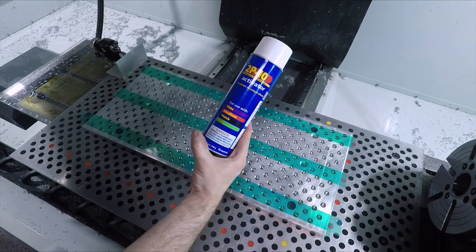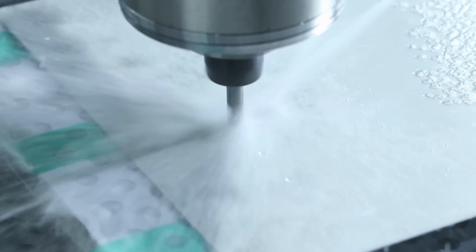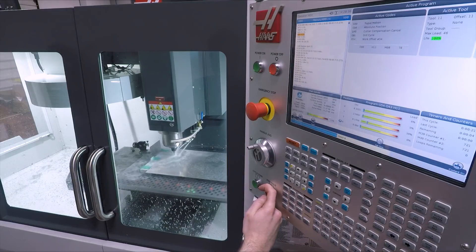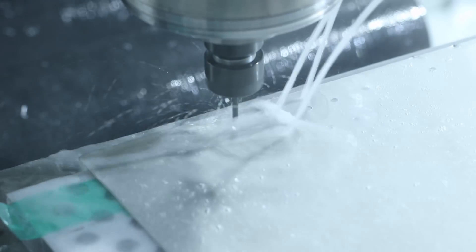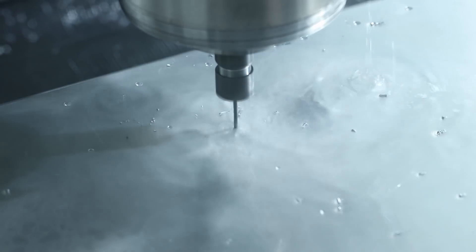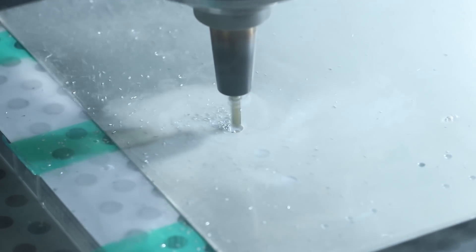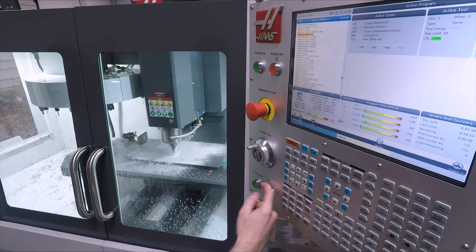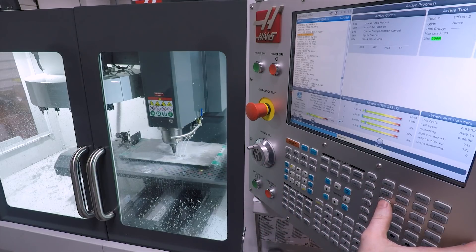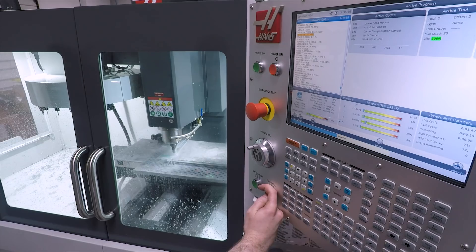In Widget 260, we had to machine some relatively large parts for Johnny Five using the classic super glue technique with either painter's tape or, in this case, high-temperature powder coat tape. The takeaway is that you don't have to have complete tape coverage — we were just putting down strips, which provided plenty of work holding rigidity and sometimes makes it even easier to remove the part when you're done. High-temp powder coat tape has two major benefits: it's more temperature resistant if your part gets warm, and it's much more coolant resistant.